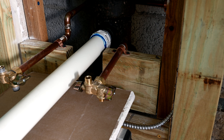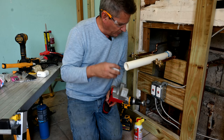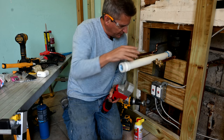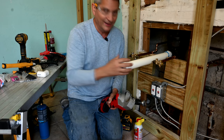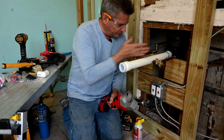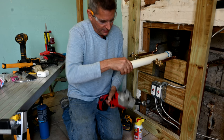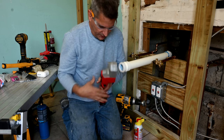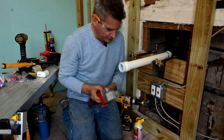I'm going to let this dry about a half hour before I do my water test. We just made our cut — I gave it just enough excess for the rough-in. When we put the base cabinet and sink in and know exactly where the P-trap is going to be, we'll cut it back down. This is the P-trap adapter, with a little piece of cardboard on here that blocks the sewer gases. We're not cementing this in place yet — we don't do that until everything is pre-cut and we know exactly where it needs to be cut. The great thing about PVC cutoff tools is the edge is perfectly sharp and clean with no deburring needed. I did a video comparing the Milwaukee PVC shear to the Ryobi — I'll put a link to that in the description.